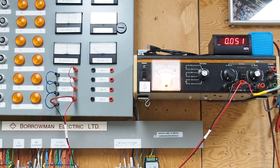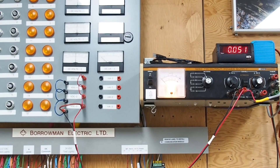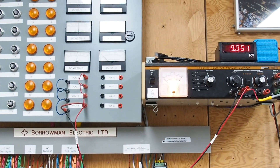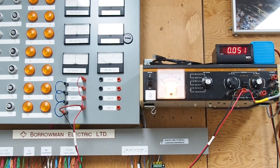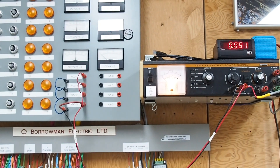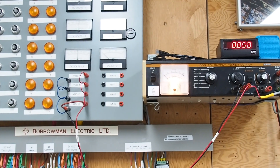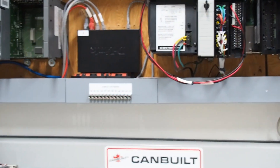So here we are back again. Here's our power supply — our BK Precision that we used in our other video. Our load meters, everything jumpered together, so I've got four meters as load. Currently we're set at zero, and on this side here you can see a jumper from positive to negative, which holds everything steady at 0.05 volts, which is pretty low. We're going to say that that's our zero reference, which is going to be the first thing the program is going to ask for.